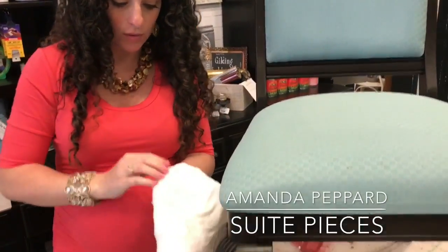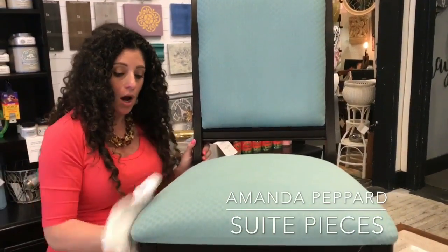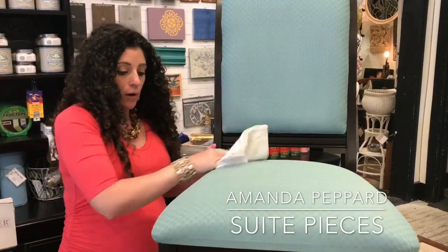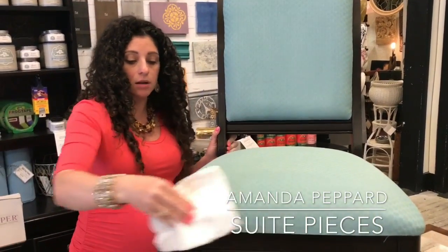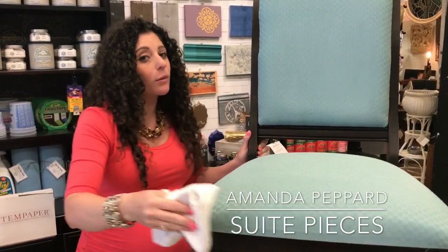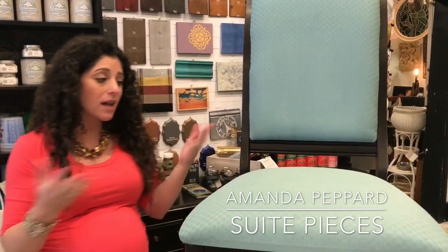Now I'm kind of polishing that wax into the fabric. You may see a little bit of color on your rag — that is normal. This paint is very highly pigmented and sometimes you'll get that even when you're waxing on furniture. Once you wax it, it won't do that anymore. Now if I feel this, it doesn't feel like there's leftover syrup — it's pretty smooth. Tomorrow it's gonna dry and cure and it's not gonna be sticky at all. If it is, just take your rag and buff it out. If that doesn't work, you probably put way too much wax on. Waxing your fabric, you really don't need a lot — this is just going to enable water and things like that to bead up on the fabric so it doesn't soak into that chalk paint and stain it.